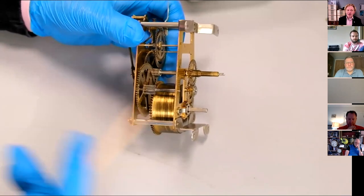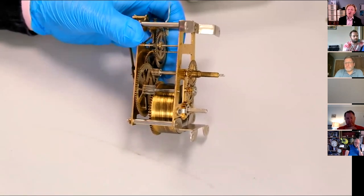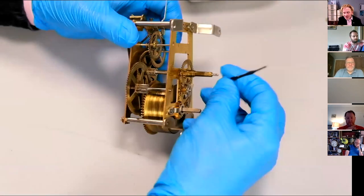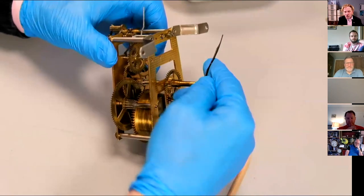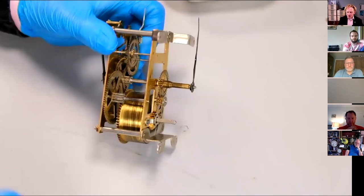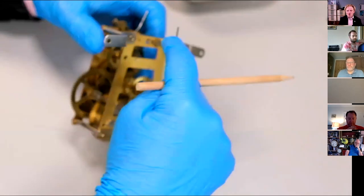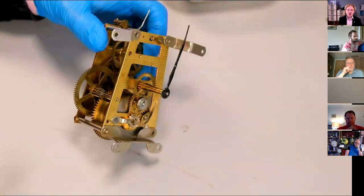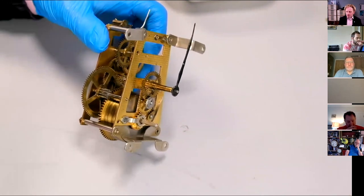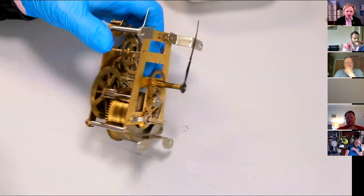Okay. And the reason we've got big gears and small gears meshing together is that it gives us a ratio. We talked about duration. We talked about meaningful rotation. For instance, you will recognize now, already learning a lot, I hope, that our minute hand goes on that shaft. The shafts, by the way, clocks people call them arbors, but anyway. So that minute hand goes on that axle shaft or arbor. So you know that this one must make one rotation every hour. It's got to go around once an hour, yeah? And so you can figure out the gear ratios from that point by counting the number of teeth. We did a session on it a couple of weeks ago here. We can come back to it.